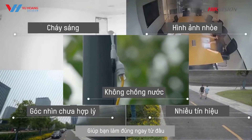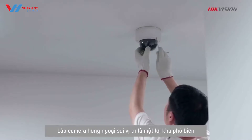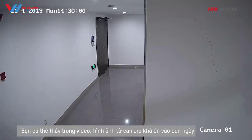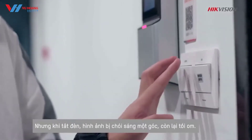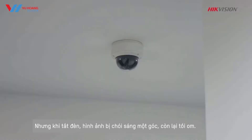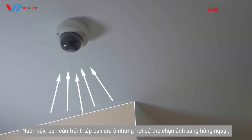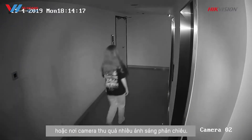Number five: installing infrared cameras in the wrong places, or in places where the infrared beams are blocked. It's pretty common to install infrared cameras in the wrong place. As you can see in this video, things look perfect during the day, but when lights are turned off the image gets completely overexposed. To get it right, avoid installing cameras where infrared lights are blocked or the camera captures too much reflected light.